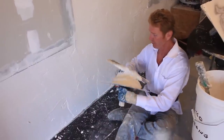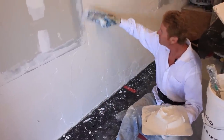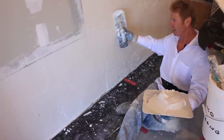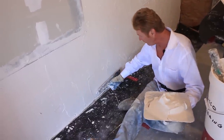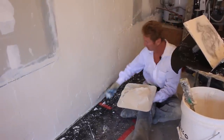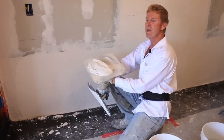Even this 20-minute mud is starting to get hard. Now we're just coat after coat after coat. One of the things homeowners ask is how are you gonna get all those lines out? As soon as this starts to get stiff, you just put your trowel on edge like so and get the lines out. But for right now, what we want to do is just build it out. We drop stuff and you pull up clinkers in the scratch coat — that's not a big deal. In the finish coat we get yelled at if we leave clinkers. I'm at the last hawk full. I'm going to let this set a few minutes, play with it, one more skim and we're done.